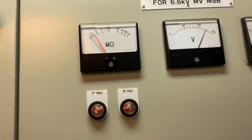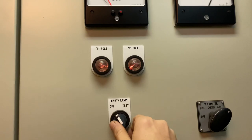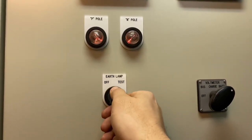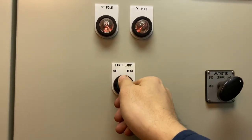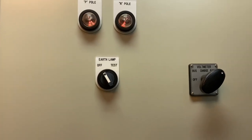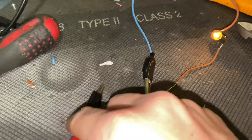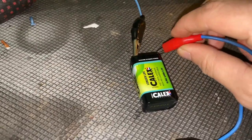Before that, I'm going to share the troubleshooting assistance that I did for one of our fellow ETOs. The earth fault monitoring system installed in their vessel has only an indicating light. Every time he flipped the test switch, one pole illuminates and the other pole will dim, so he was not sure about the condition of the system with that kind of indicating light.